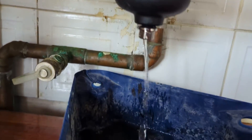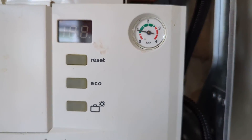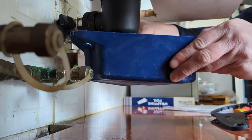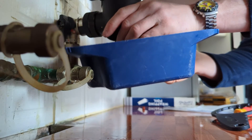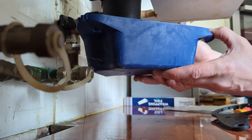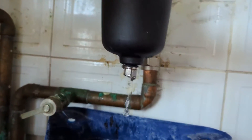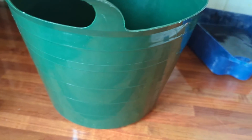But I decided to do it using the filter on this occasion. On this filter you've just got the nut underneath which you undo. You've got to be really careful — if you just unscrew that, you've got one bar of pressure of water. You've got to be a little bit careful. Even with taking that bit of water out I've still got half a bar of pressure, so get a big bucket underneath and we should be okay to get that nut off and just drop the water out of the boiler.